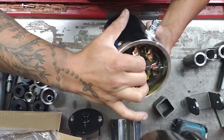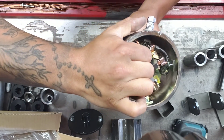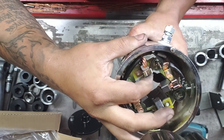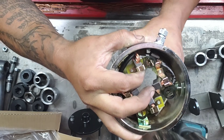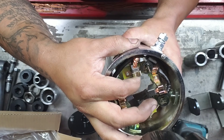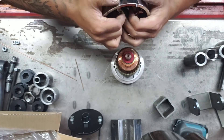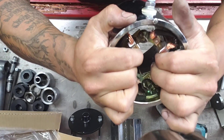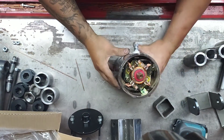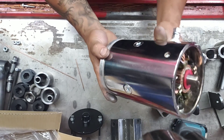When I first started doing this I remember I used to just drop it in and get frustrated because I couldn't do it. So that's why we're doing this video — to make it easier for you. Make sure you're pushing these brushes all the way back into place. You'll see the little gold rectangle around each brush — the brush has to squeeze all the way back flush against it. With all four fingers pushing against each brush and your palms on the casing, you open up the gap and can drop the armature straight in. There you go.